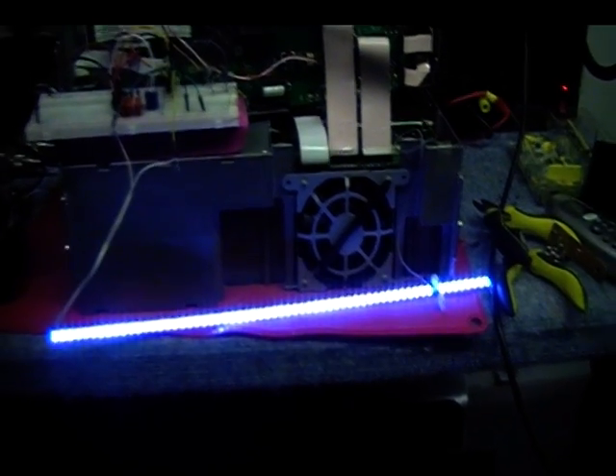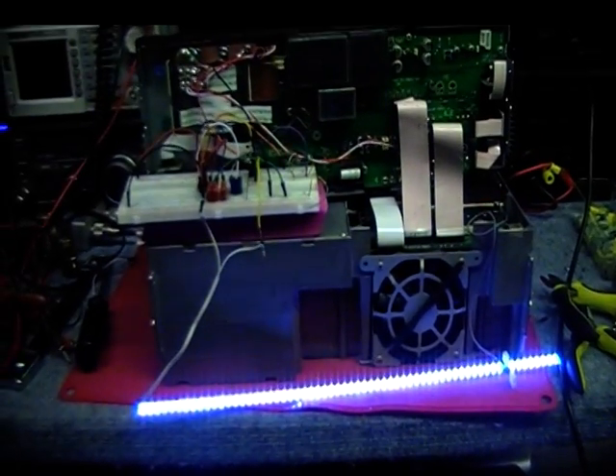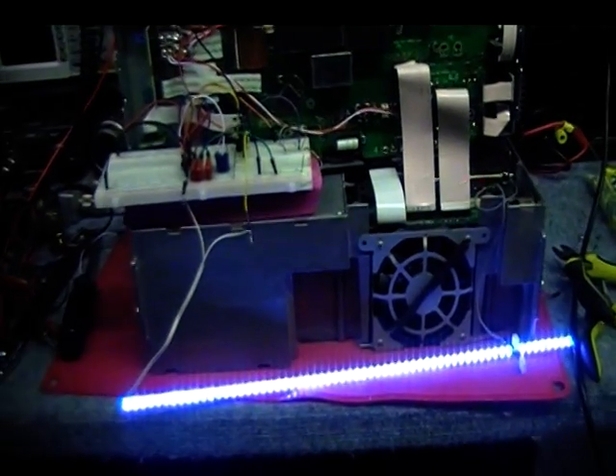In this Video 3, hopefully the final one, I've put together a circuit dedicated just for adjusting this screen. It's a little more involved — there's an op-amp in the circuit. It tracks the voltage of the adjustment and controls the transistor, keeping it tracking so we can adjust via a preset. We can set it so the screen goes completely off up to full brightness as high as the internal adjustment goes, then the on-screen adjustment gives us the full range.